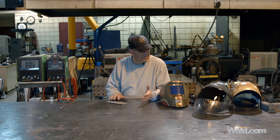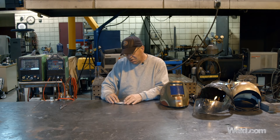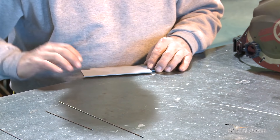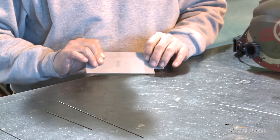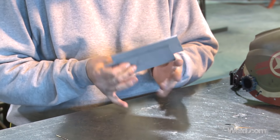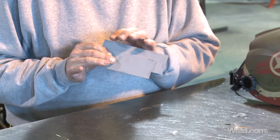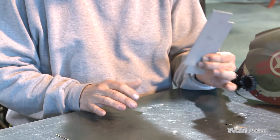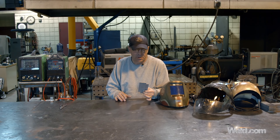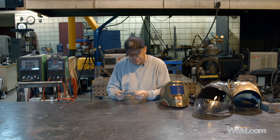As far as these videos, we show the right and the wrong. What we want to do now is just a simple lap weld — and to me the control gets a little finer, and that's the whole exercise: trying to control what we're doing. If we put our material together like this, we create a lot of weld area and we also have the edges that we can weld on.